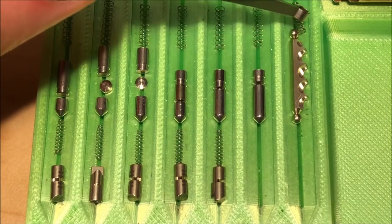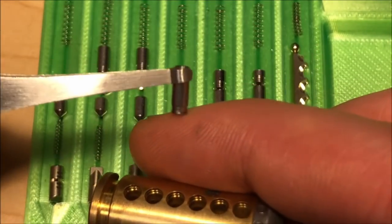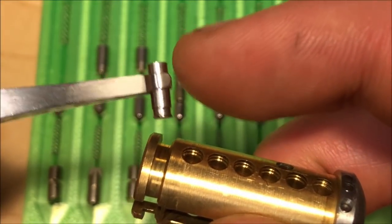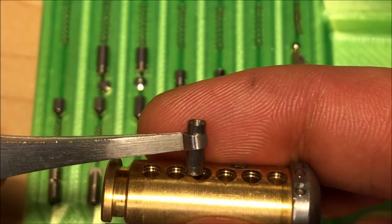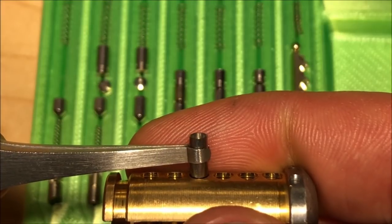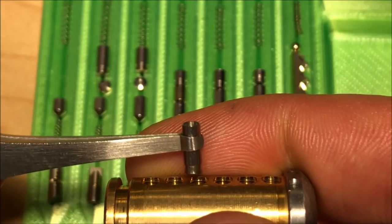Lastly, the operation of the actual barrel spools — why are they shaped like this, and why do so many people fear them? These are designed to interface with counter milling inside ASSA locks. You can see this little distance where it goes from the outer diameter to the thinner diameter before the tip, and inside this lock are two levels of serrations or counter milling. At exactly this level you can feel it catching, and that is exactly where the diameter constricts — that is where the first serration is. Then there's a second serration, and then it gets freed.